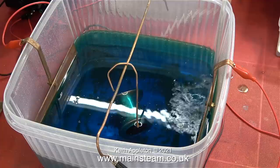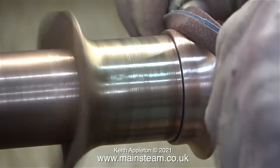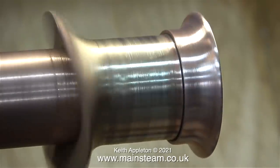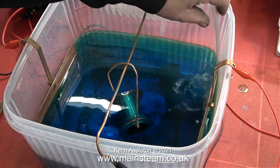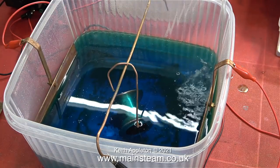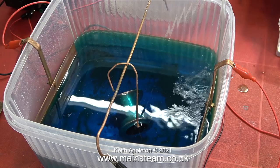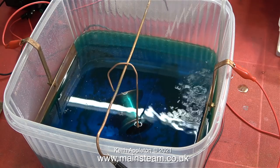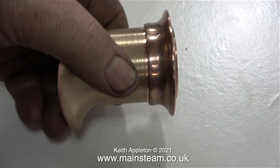This time the electroplating results were quite different. The second plating came off like metal foil — quite thick pieces too. It was so bad I had to put the chimney back on the mandrel in the lathe and, using emery cloth, I removed the scabby plating from that attempt. I plated it again — this time I moved the airstone further away. If you look closely at the surface of the copper sulfate, you can see it's moving even at the other side, well away from the airstone, and that is all I need. When the airstone is too close to the part being plated, the air bubbles seem to be a problem and the plating isn't very good. All you need to do is just keep the liquid moving.